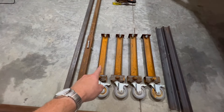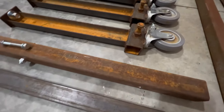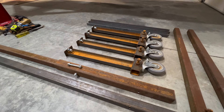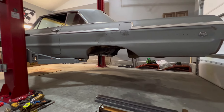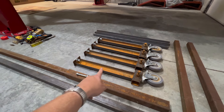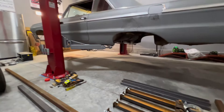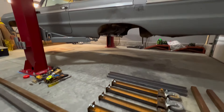First things first, I made the legs first. These are just six-inch casters with a one-by-three-by-two C-channel that I've welded a two-inch ID box tubing on, and I'm using five-eighths nuts and bolts. I know these things are rusty but I've had them outside forever. The legs themselves I built specifically for this body, and if I was to do this over again, the one change I would make is I would make these legs sleeved so I could raise them up and down for different heights.